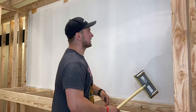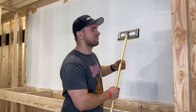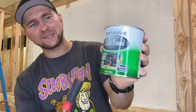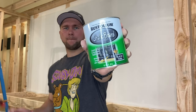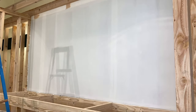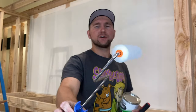Now we're going to grab a sand pole, one of these guys, and just really lightly — I'm not trying to sand it off but I do want to make it a little smoother, so I'm just going to lightly sand it. Now we're going to actually get the chalk paint on it. Make sure it says chalkboard, not just chalk paint, because there's chalk paint for your furniture. Make sure you're getting this exact paint right here. We're going to use our brush to cut around the perimeter and then to roll it out I'm going to be using a foam roller — not a nap cloth roller — because this will give you a better smooth finish.